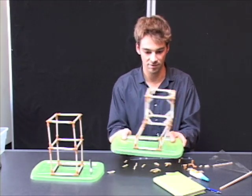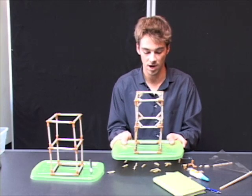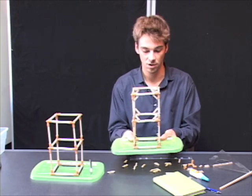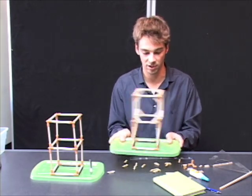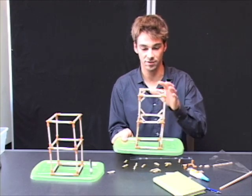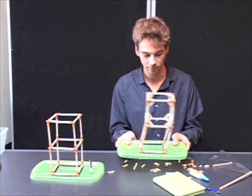you can see that the building is now very weak. This is very similar to buildings that are used with tuck-under parking or stores in the bottom floors. Buildings are built like this all throughout the United States and are still built like this in third world countries. So even though the upper floor is stiff and strong, the lower floor is no longer strong at all.